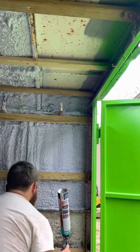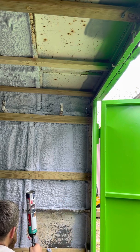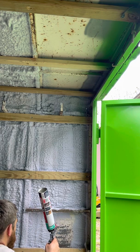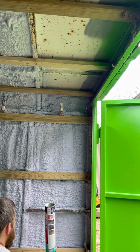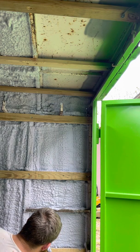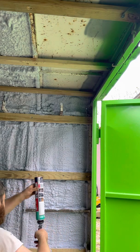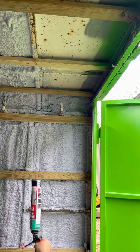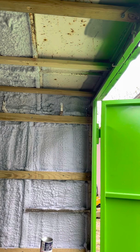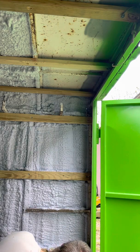For a camper, I prefer to convert steel and aluminum body trailers into campers. It costs about the same as buying a camper, but it'll last a whole lot longer than most of these campers that you buy at big camping supply stores or RV centers. Those things are going to rot out typically and have all kinds of problems. These, you can put your electrical, you can use the conduit or the piping that these things come with that are built out of the frames. You can typically use that as conduit to get your wires where you need to put them, your 12-volt wires.